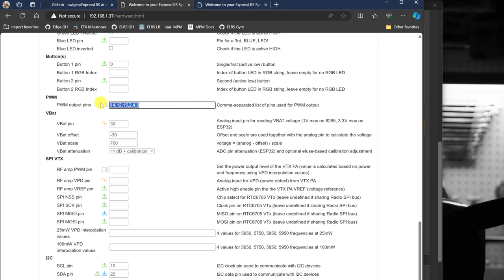You can get SCL and SDA off the board if you want to solder onto the pads of the processor, which I don't. So that's a really fine soldering job. If you have that kind of soldering skill, then go ahead and figure it out. You're a smart dude. If you can solder that small, you already know how to figure this stuff out. So grab the SCL and SDA pins off the MCU pad if you want. But if you don't, you want to be mortal like the rest of us, you're going to steal pins 7 and 8. That's why I'm using an ER8 and not an ER6.